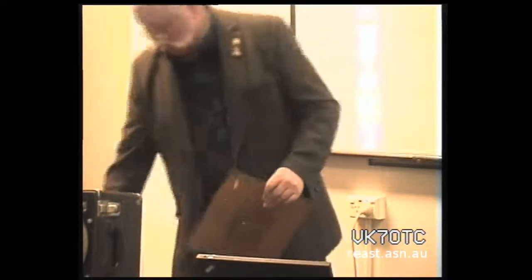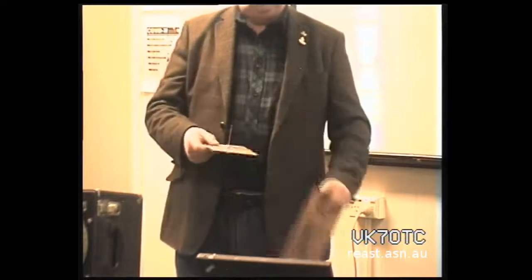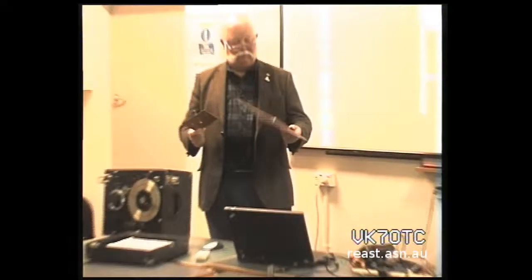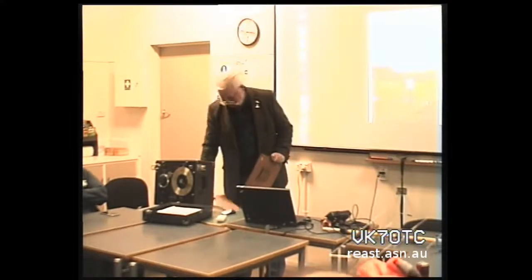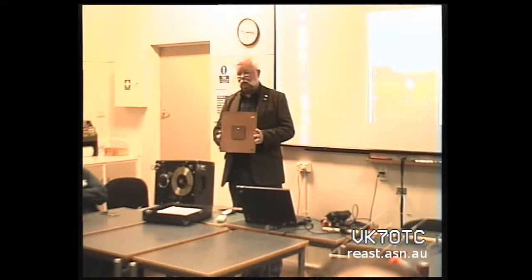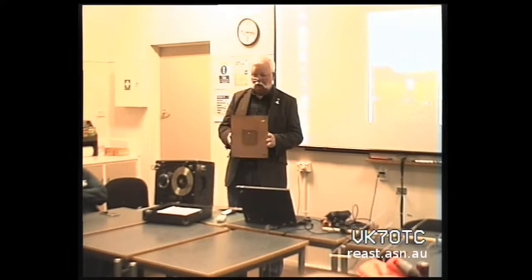I'm thinking, that's ridiculous. But it does do that. So I constructed a few of these, which is, when you've got 70 foot and 80 foot verticals, waving a quarter wave vertical around like this is sort of fun, really. But I was able to pop them together to measure the gain of this thing. And the gain of this thing is, on my measurement, about 7 dB over a dipole.